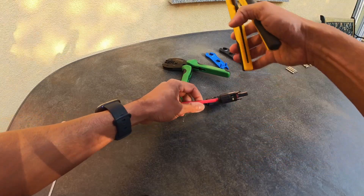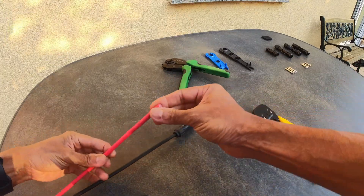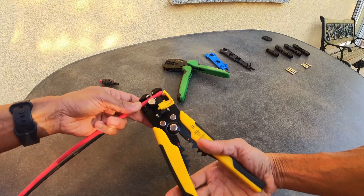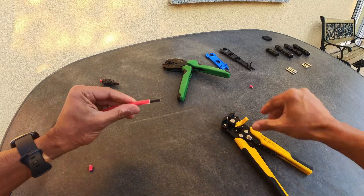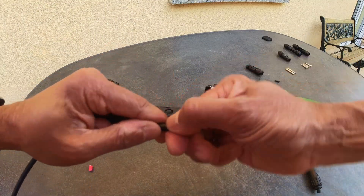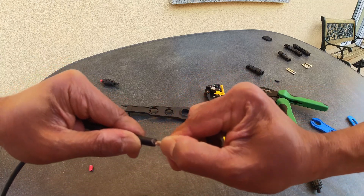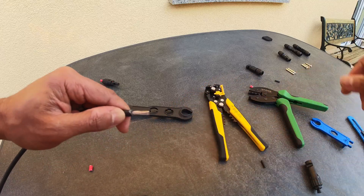Now this is how the wire cutter works — pretty simple. The wire stripper is the exciting part. Note how one jaw grips the cable insulation and the other pinches the surface and pulls. The tool did not manage to strip the inner sheath, however, but that being thin and soft was easily removed with a knife without damaging the wire strands inside.